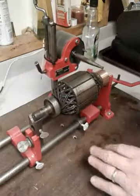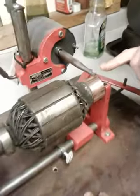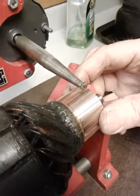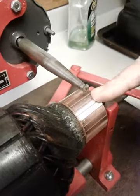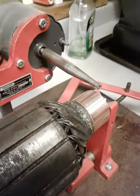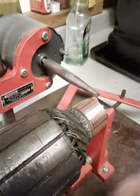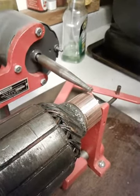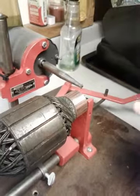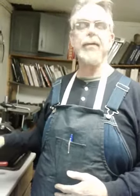I'm going to walk over here back into the other shop. This is a mica undercutting tool. I've got an old junk armature set up here. There's a tiny circular saw blade about the size of a pencil eraser on the end of this shaft. What I would do is rotate the commutator, lower this down so that saw blade fits in the groove, then move it back and forth to re-cut that mica. Then rotate to the next slot, move it back and forth, cut that mica — all the way around until the mica is re-cut down below the surface. Fortunately this one is in good shape so I don't need to do this.